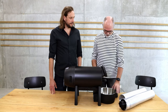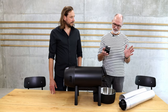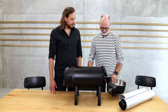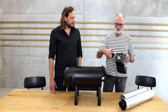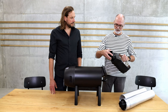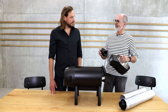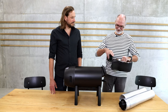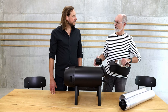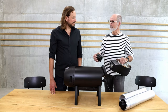Well, we provide a part C on our website, which is actually the connection between the cooling tray and the hose. So simply what you do is you remove the four screws here on the cooling tray, put this on and put back the screws. Okay. So again, kind of a passive system. Yep. You will just use the ventilator in the cooling tray, which is pretty strong. And it's enough to just push the air out several meters.